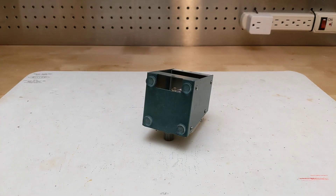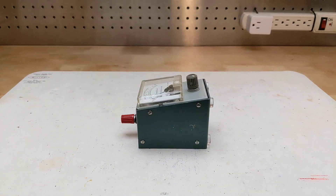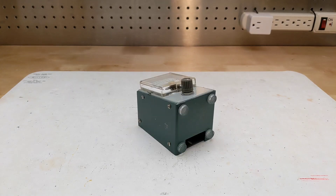The original magnet in the case was missing. While I could glue one or two magnets to the inside to restore this function, I chose not to do so as I'm unlikely to use it mounted on a metal surface. The antenna wire was missing, so I made one similar to the original using a banana jack and a 12-inch length of heavy copper wire. The sensitivity control was a little stiff until I lubricated it with oil, and I also added some adhesive rubber feet as the originals were missing.